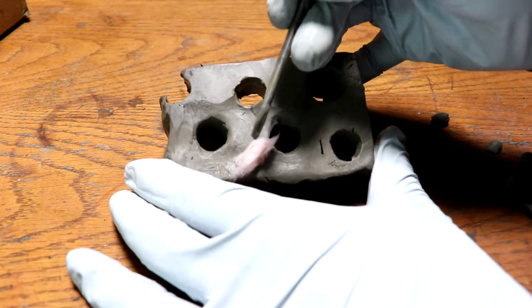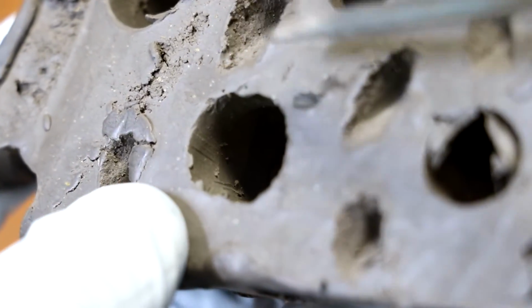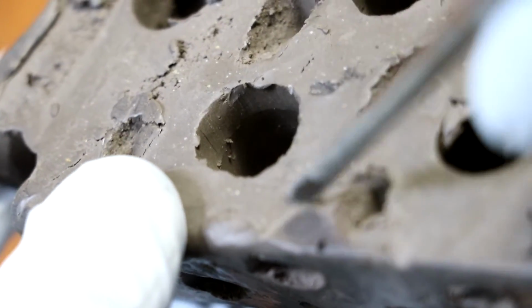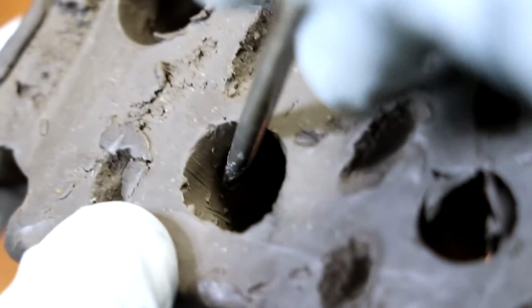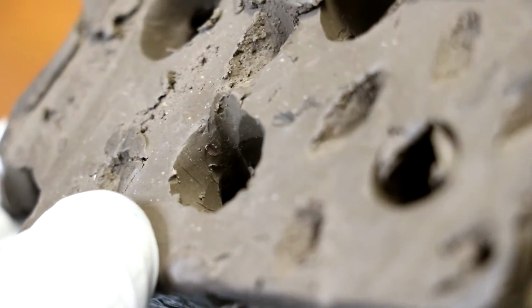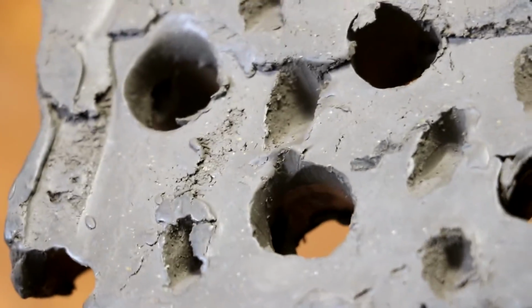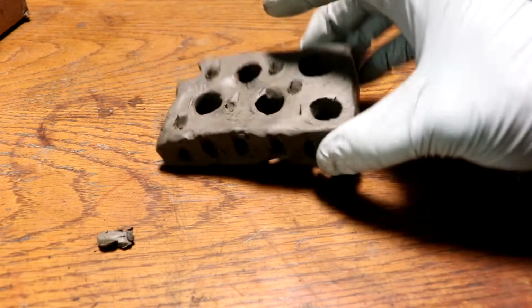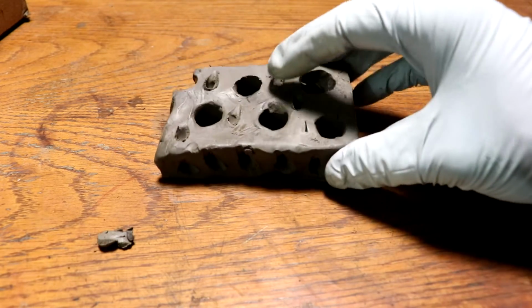There might be a piece of ash that the water can't react through. Water can also last long enough that instead of reacting with the first little bit of carbon it runs into, it can actually bounce around and make it down into the pores before reacting. So even the inside of the pores can become more porous. Eventually the piece of carbon will look like a snowflake, fractalized. In fact, it's reasonable to assume that I could increase the surface area by a couple of orders of magnitude.